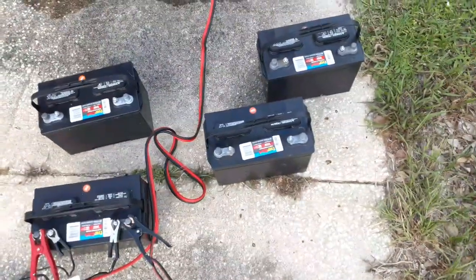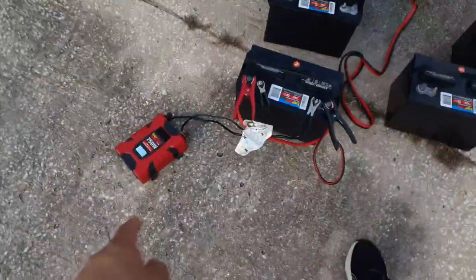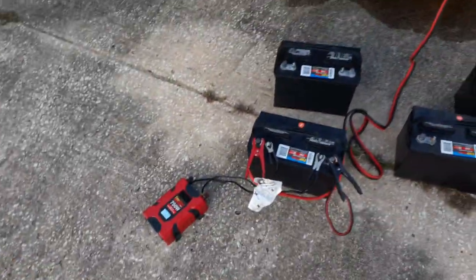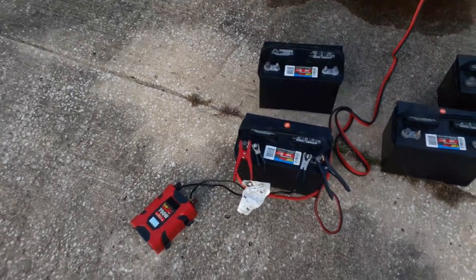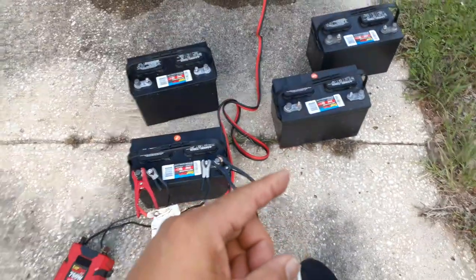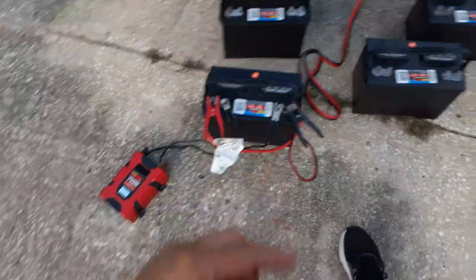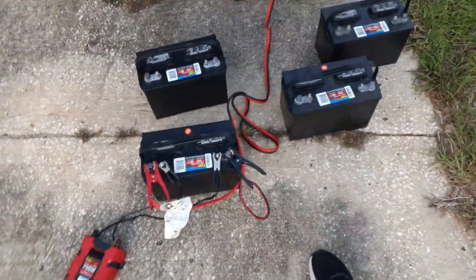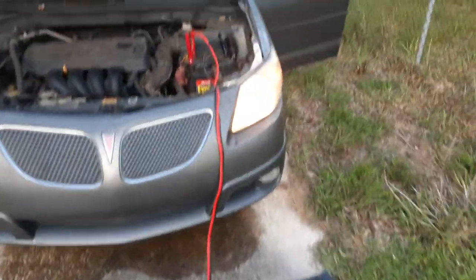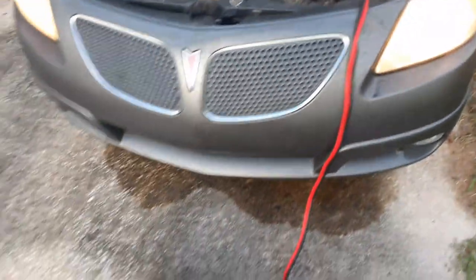So I don't know if I've damaged these or not, because it would run all night. But the power inverter — the same one that I have in the RV — it shuts off and just beeps when the power drops too low. So they were all reading 12.2 when that thing shut off. So I was trying to protect the batteries, and maybe it did protect them. Right now I'm manually charging each battery through the car's alternator to try to send enough voltage out to hopefully jolt it back to life.